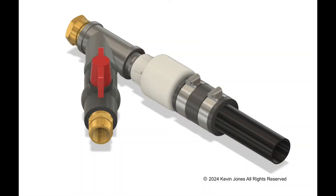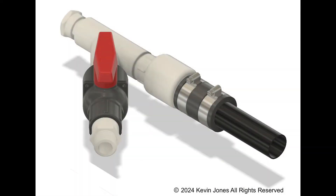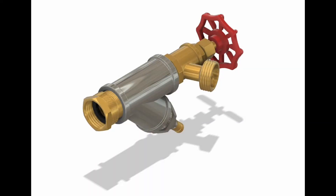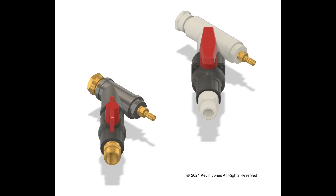The shop vac had trouble opening the one-way check valve. I even thought about making the whole thing out of PVC, but I was concerned about blowing air through PVC. So I went with this design, made out of metal — brass drain valve, as you can see. But the drain valve has a small opening, so I decided to go with a larger opening with these ball valves.